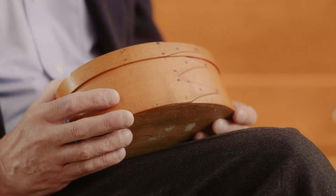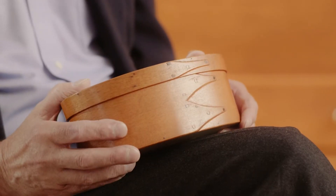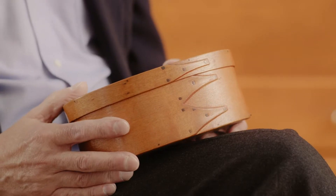The flaw usually had to do with the way that the overlapping sides of the box were joined. The rims — the Shakers called the sides the rim — had a propensity to buckle and crack over time. This occurred because there is a normal organic response to seasonal conditions that wood goes through.